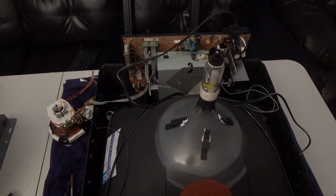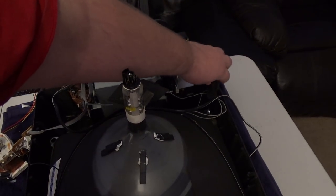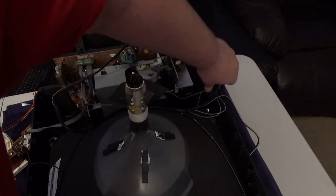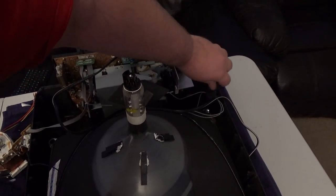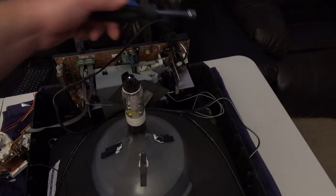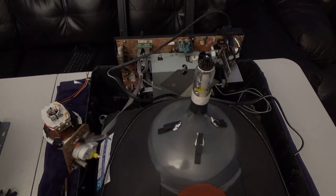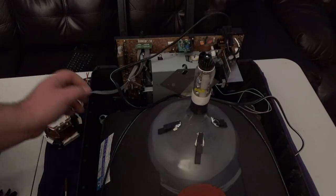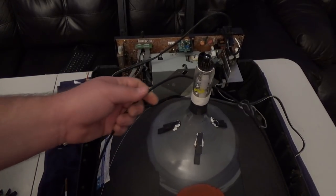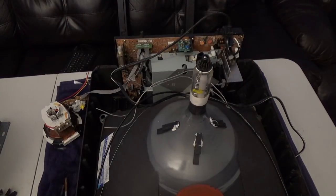I already discharged this tube. I'll disconnect the ground and the degauss coil — by the way, it's pronounced 'degauss.' The four bolts are off. I'm going to separate the ground up here and pull the tube clear out of the TV, setting it gently on an old towel so I don't scratch the front of the screen.